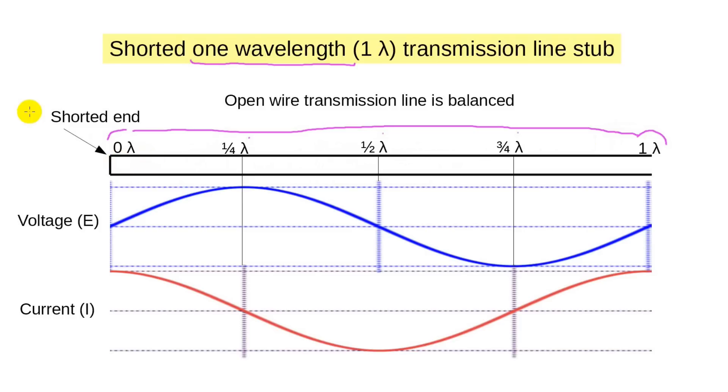Now our first big conceptual leap is coming into view. Let's short one end of the transmission line over here at the left. This forces the voltage between the two conductors at that point to be zero. Given that this is a full-wavelength transmission line, the voltage waveform looks like the blue line — at its maximum at a quarter-wavelength, back to zero at a half-wavelength, at its negative maximum at three-quarters-wavelength, then back to zero at a full wavelength. No matter what else you connect this full-wavelength stub to, the voltage must assume this form because of the short. Now let's take a look at the current. We see the same sine wave, phase shifted from the voltage waveform by about 90 degrees. The maximum current must flow at the short, with zeros at one-quarter and three-quarters wavelength and back to peak at the one-wavelength mark.